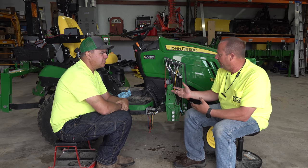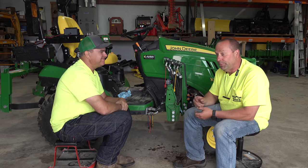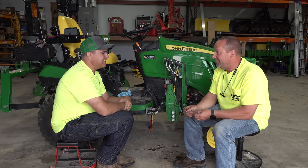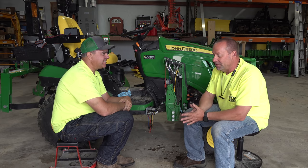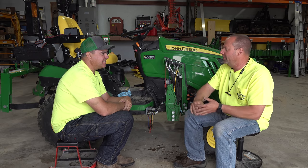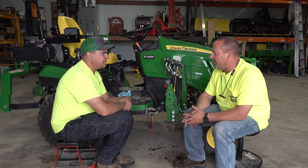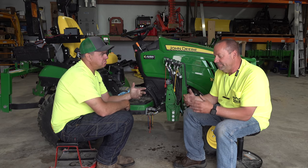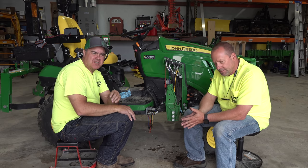The Hy-Gard fluid that John Deere uses, the Super UDT fluid, that Super UDT2 fluid that Kubota uses, it's very clear. That color is hard to see. And the dye won't hurt the system. You can use it in your Kubota, in your New Holland, in your whatever. It works great. It's inexpensive, when you consider the cost of hydraulic fluid. I haven't used it, but Ken's been using it for years, and he loves it.